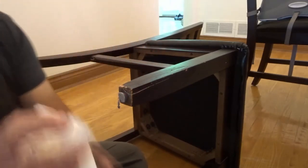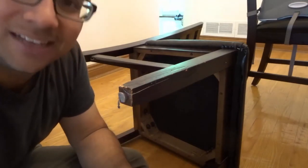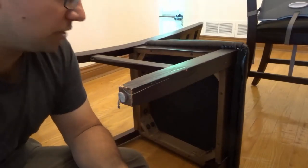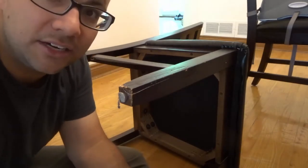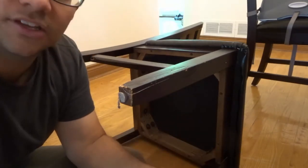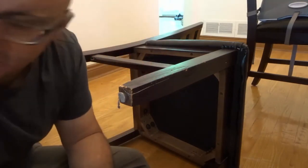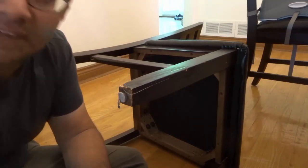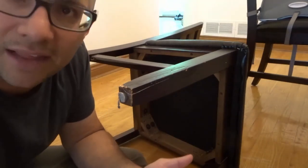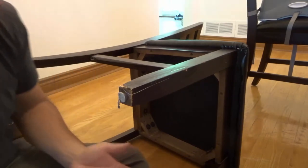Now here is probably the hardest part: don't touch it until the wood glue has dried. I know it's hard because you're going to want to touch it and make it perfect — don't touch it. The more you touch it the harder it's going to be for the wood glue to dry and actually adhere properly. Leave it alone, look on the container to figure out how long it takes to dry, and if you want to be safe, double that time. If it says two hours, leave it for four hours — there's really no harm. Let it dry and you'll be good to go.